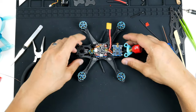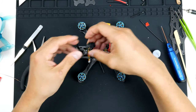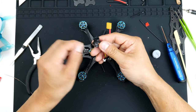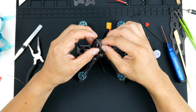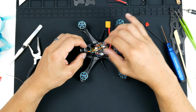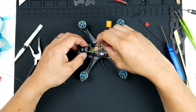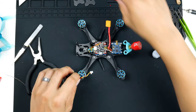And the only last thing is the camera. So we do have the camera here. I'll need to extend these because they're not long enough, I don't think. And you're probably wondering, why do I have this micro or nano camera, which is a Runcam Nano 2. I harvested this one from a Tiny Hawk 2 since the ESCs were busted on that and I can't be bothered to fix it. So I decided to use the camera on this one and the wires will not reach. So I'll have to wire this up and extend it. So let's give that a go